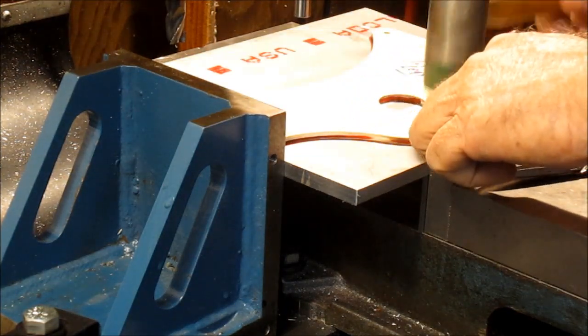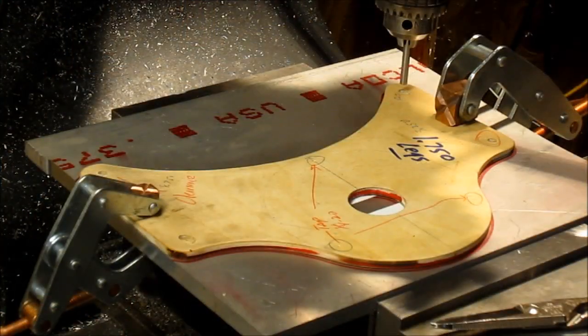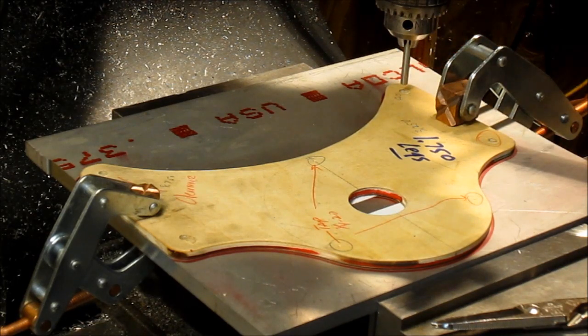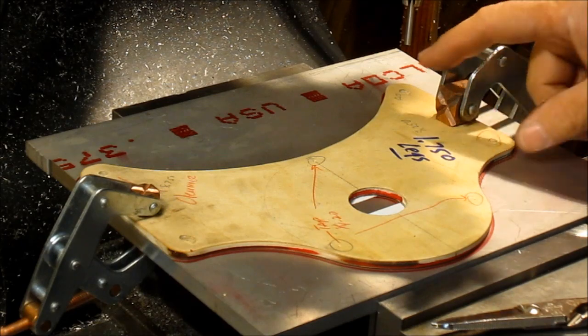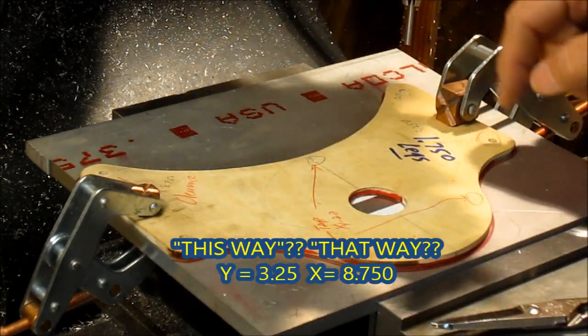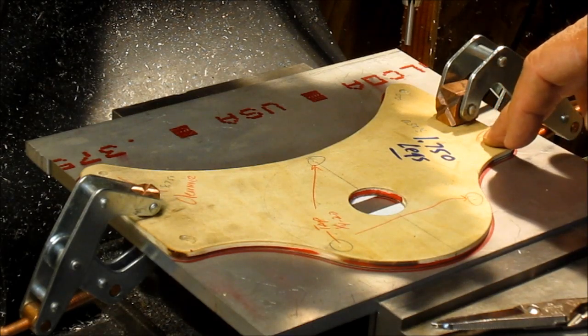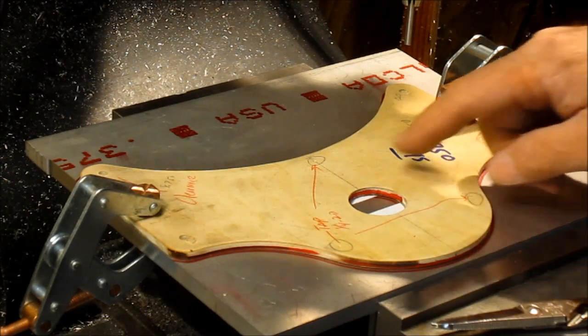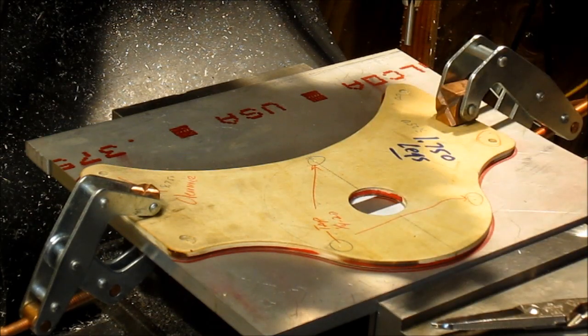A little springy here - I think we're on there. Alright, time to punch some holes. What I've done now is put a gauge pin in that is the same as the number 10 drill, and use that to locate this hole. I had the dimensions - three and a quarter to come this way and eight point seven five to go that way. I can go ahead and punch the actual bolt clearance holes for the plate itself, then pick up the actual holes I need to drill and tap for a quarter-twenty, and punch out the center hole also. I'm not going to film it - pretty obvious what I'm going to do - then see you at the router shortly.